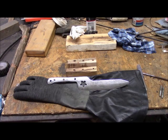Well, how are we doing with our knife? The design is completed, and this is about how I hope for it to look. I have the scales cut out, and the pin's ready, but that blade is still not hard enough. It is feathering when I grind it, which indicates that the steel is still soft. Consequently, I'm going to have to raise the heat treatment from 1850 degrees for 30 minutes to something higher. But that is, I think, for another day.